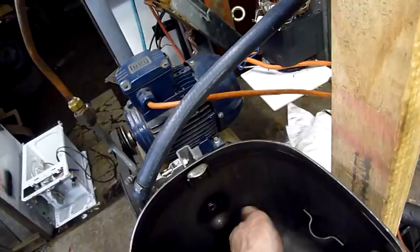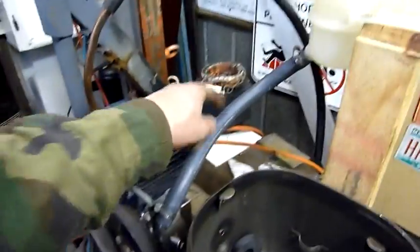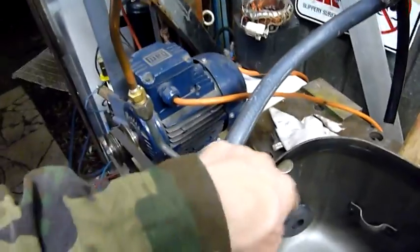That's the oil tank — that's the outlet to the pump. As you can see, that's a magnetron magnet to pick up any ferrous particles. It won't do anything for the non-ferrous and non-metallic stuff, but it's better than nothing. It'll stay over the suction side of the pump. All I've done is weld a couple of tabs to it with the arc welder. That's going to be modified and fitted to the housing after a bit of reinforcing work.